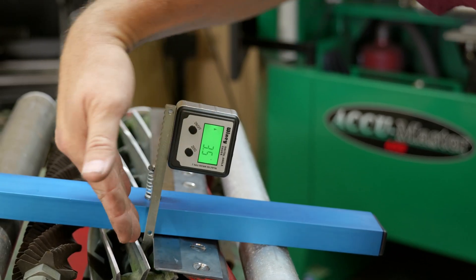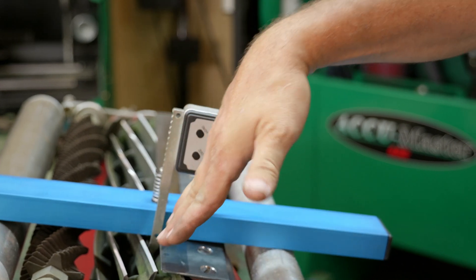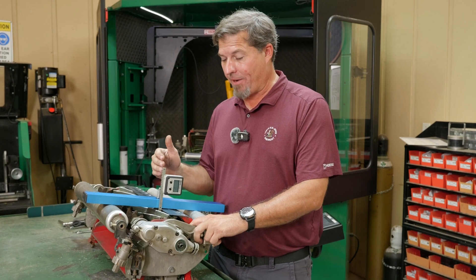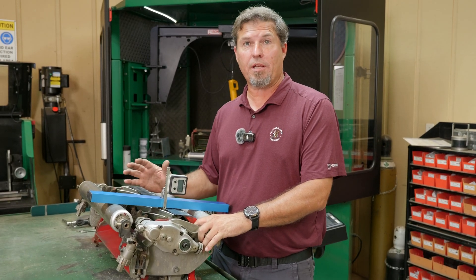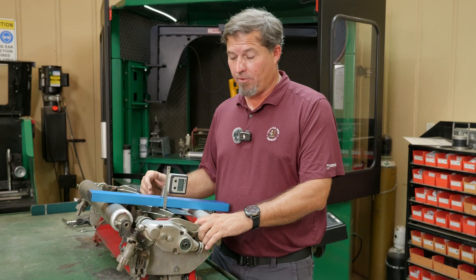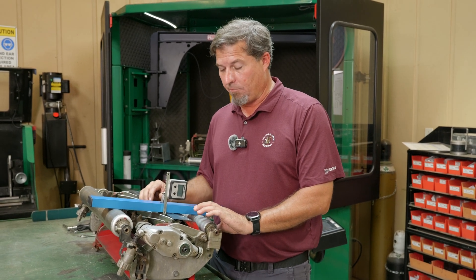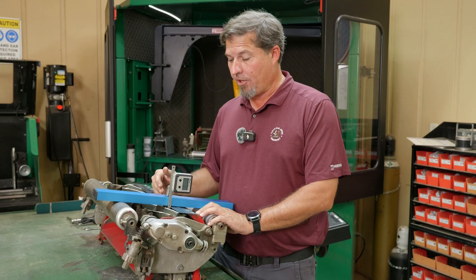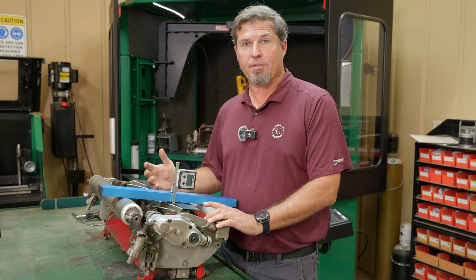When we had the extended bed knife on, we were at a shallower angle. The standard bed knife is a medium angle, and the short bed knife is a steeper angle because the behind center distance is moving more. One of the great things about the BC Master is it allows us to put a number on our behind center distance. If your greens are perfect, you note that number, and then in a month when you start seeing some scalping, maybe you can go to an extended or add a spacer. For example, running a black bed bar with an extended knife put my behind center around 2 degrees, while a standard knife on a red bed bar was 4 degrees. Being able to play with those numbers gives us more options to mow our turf.